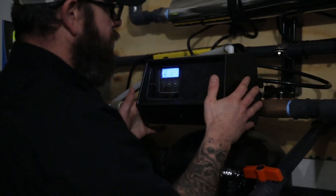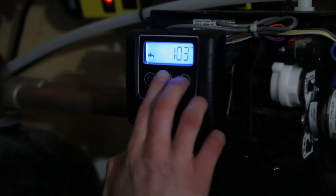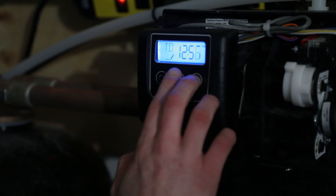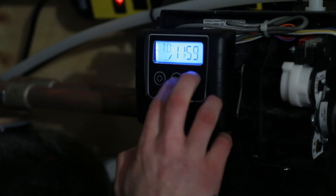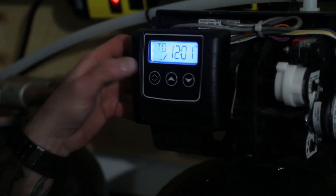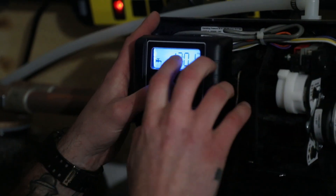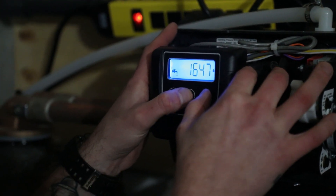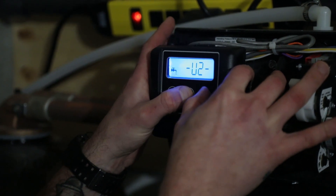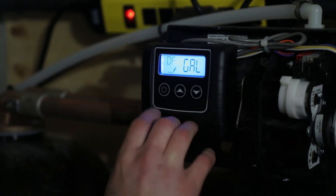To navigate the clock to 12:01 PM — you've got to have it read 12:01 PM — press and hold the down arrow and back it up to get to 12:01 PM, then hit the far left key one time. To access master programming you've got to have it at 12:01 PM. When 12:01 PM comes back around on the screen, press and hold your up and down keys simultaneously and it'll give you your first screen.